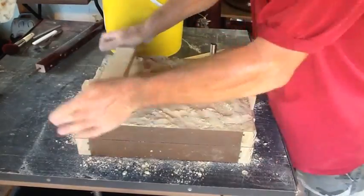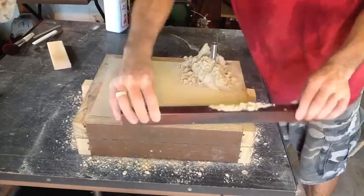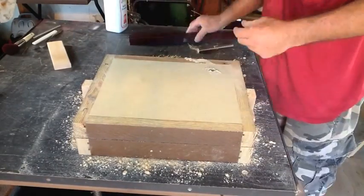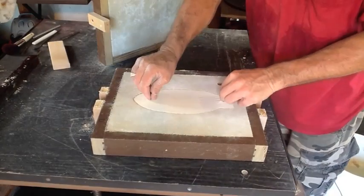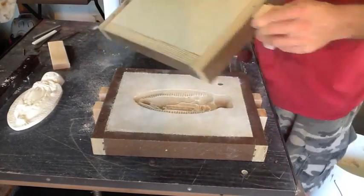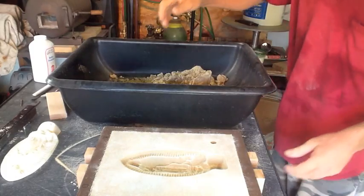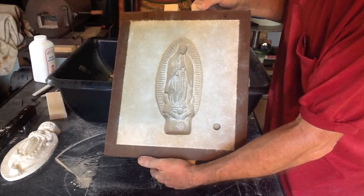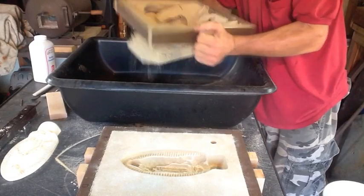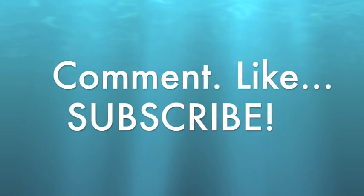Sometimes you have to add more clay because it gets burnt out over time. How I make my green sand seems to be one of the most common questions, so I thought I'd do a dedicated video on exactly how I do it. It's very inexpensive to make and it works great. Rather than buy bentonite clay, just grab some kitty litter and pulverize it — as you can see, it makes a really nice mold and it works well. I hope this video helps everybody.